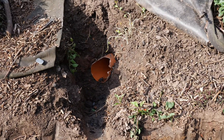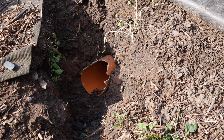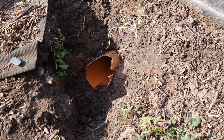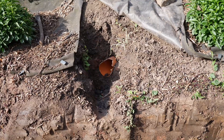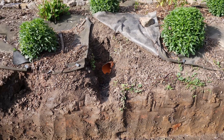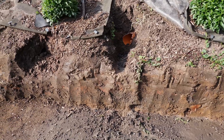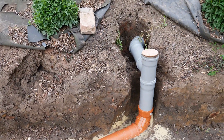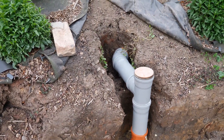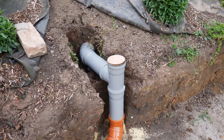Instead, compacted frost protection material and bedding gravel will have to suffice as the base. I've also exposed the end of the drainage from the driveway. The pipe was previously already badly damaged and almost completely clogged with soil and mud. This pipe will also be reconnected as part of the project and the excess water will be drained onto the lawn. The overflow is connected and I've built an inspection hatch over it. If there's a blockage, I can flush the pipe clear here with a cleaning rod or a water hose.